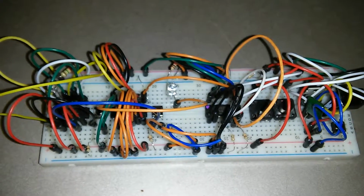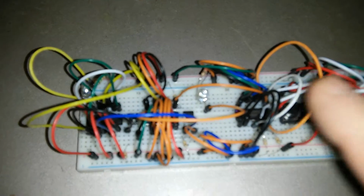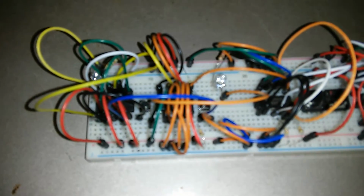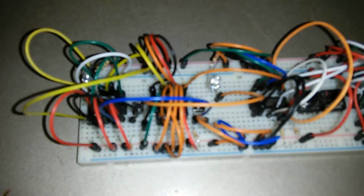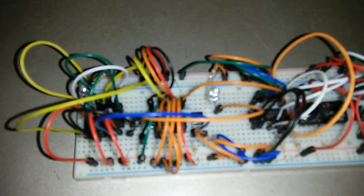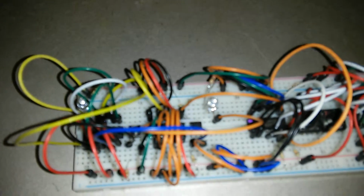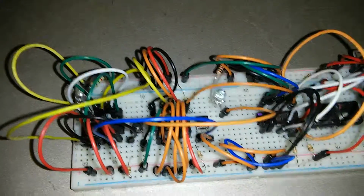If you remember when last we left this yesterday, we had light goes on, light goes off, latching this NOR chip with this NAND chip down here. I studied the issue of NANDing and latching a little bit further, and you can latch with a NAND chip, but both inputs to the NAND latch have to be high, and I needed to be able to figure out how I could do that with push buttons to turn it on and off.